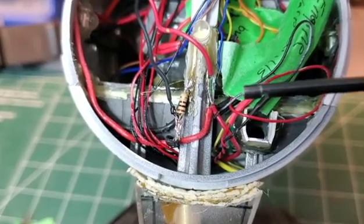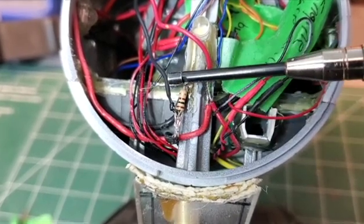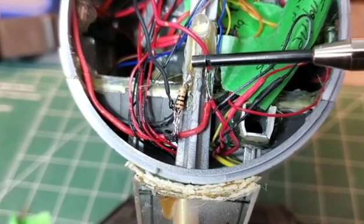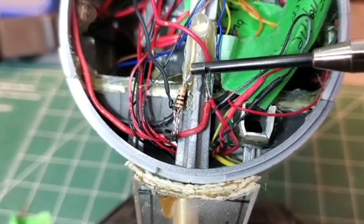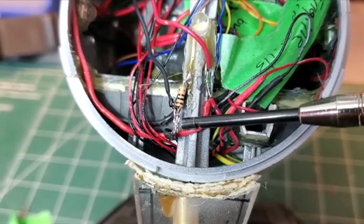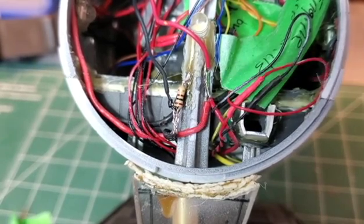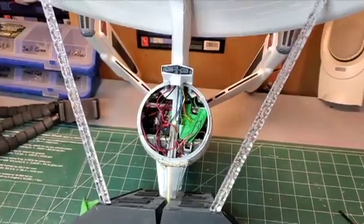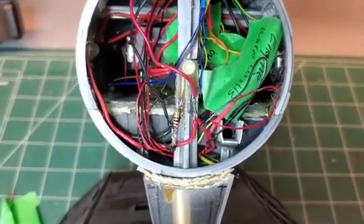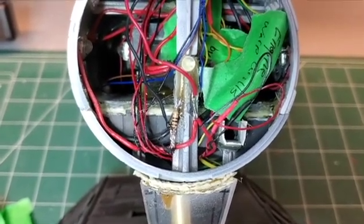Okay, now you can see I got the main power coming in here, and then I got the flasher hooked into this side, not that side, because when you hook it into that side there, the power is reduced. I don't want it reduced for the circuit, so that's where it goes. And positive on that side. I forgot to mention, I put a 100 ohm resistor on there. I reduced it from 180. I just want to see if it's going to still work.